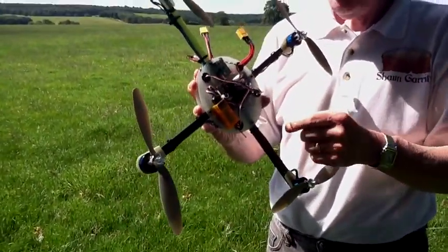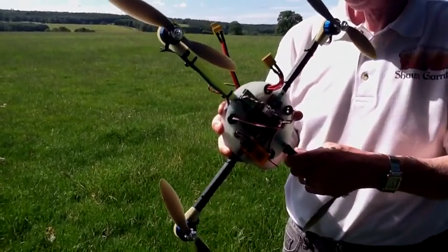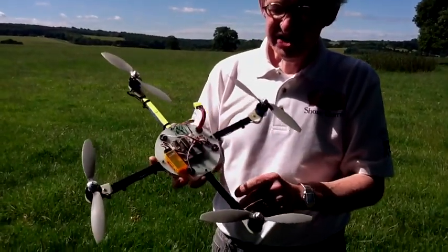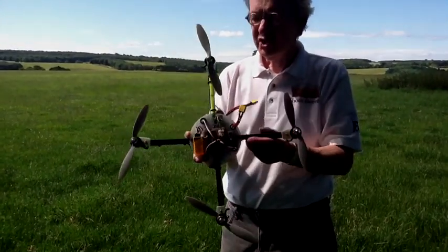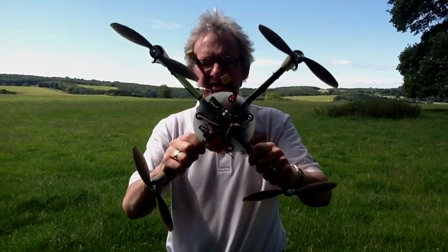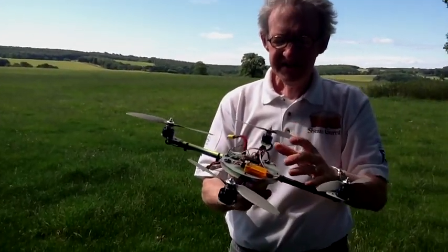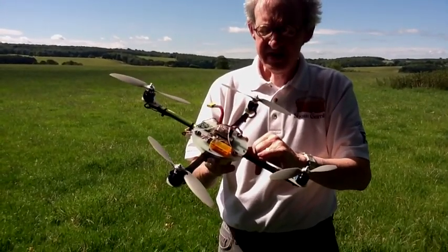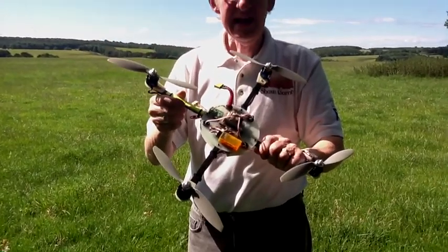Rob Day is my partner in crime in this. Are you and Rob doing the frame kits and PCB kits? That was the intention — we've done extensive testing. The idea is it's going to be called the Changeling. Within the kit you can build it as a quad-plus or quad-cross — those are two different flying configurations — and then there's the tricopter, which has the boom at the back and the rear motor is rotated with a servo. The booms in the kit are aluminium; carbon booms are not very strong. I built this one to be silly light and fast — aluminium is the way to go.